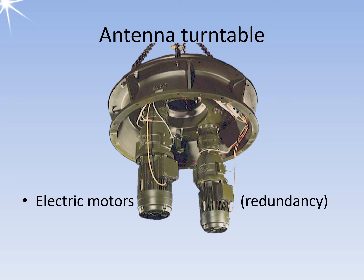However, controlling both electric motors can be complicated, since driving one motor while letting the other rotate passively is not an option. Both electric motors must drive equally to distribute the load. If one electric motor applies more load, the other would work as a generator, increasing the load on the driving motor. Such a system would cause uneven rotation and result in instability.